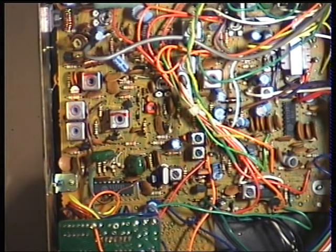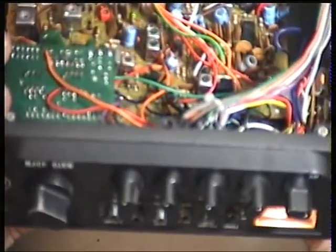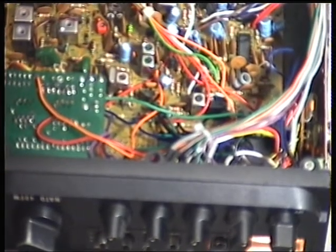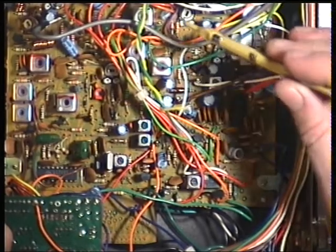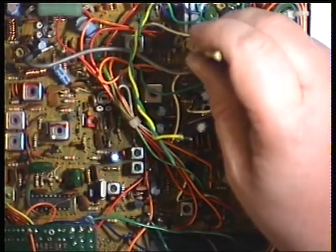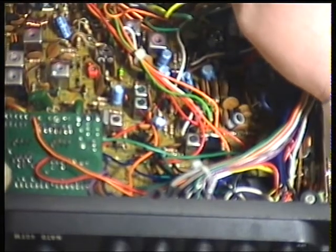While we're on 100 microvolts, we'll make sure the S-meter is reading S9. I can't even see the needle — get the magnifying glass on it. Oh, it's pegging the scale, that's why! The adjustment for the signal meter is RV2, and RV2 is there. That's now reading S9.